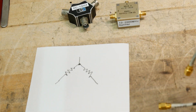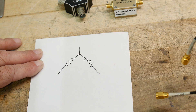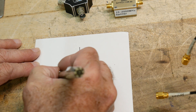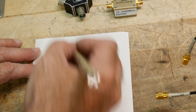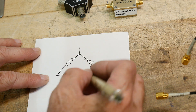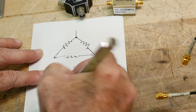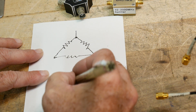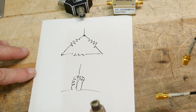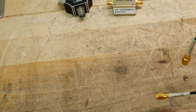So what is a power splitter? There's incoming RF and it gets split up into two halves. Sometimes there's a resistor to balance things out, and there'll be three connectors — an in and two outs. Other times, instead of a resistive network, there might be a transformer. There are different ways of doing it, and they all operate at different frequencies.